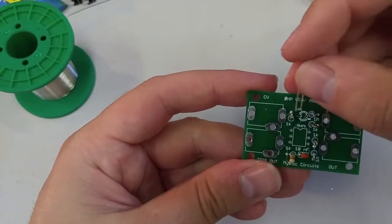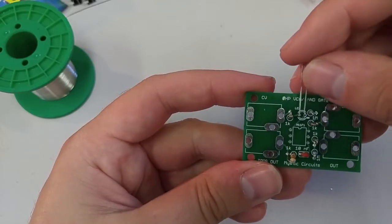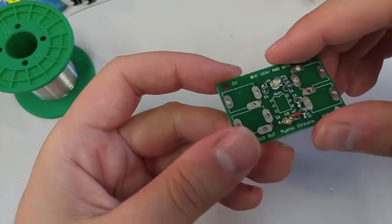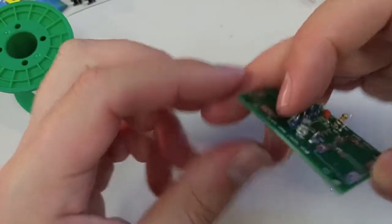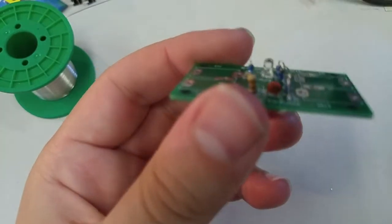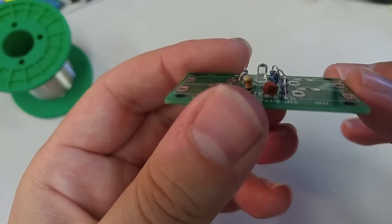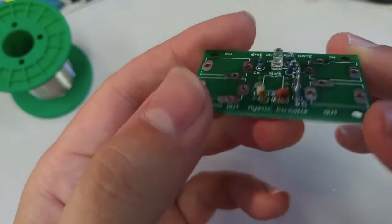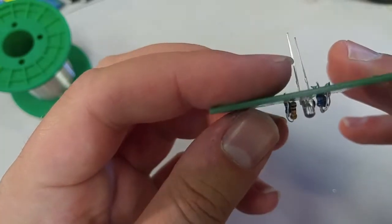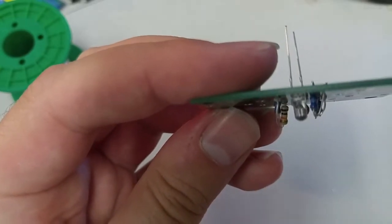You see that? Let me try and focus this a little better so it's completely clear. LED short leg goes to the minus sign. If your project is not working, I would say there's a large chance it could be this problem. If you want to verify that your LED is in the right way, it's kind of hard to show on camera, but you can actually see the right side of this LED is flat. It's really not showing up very well, but trust me, in person, it's a lot easier to tell. Right side of the LED is flat.